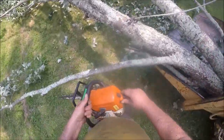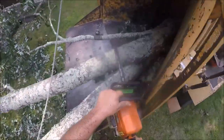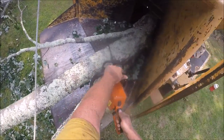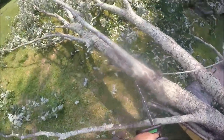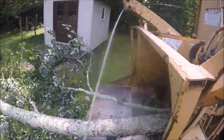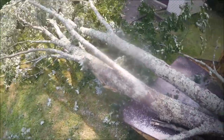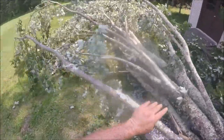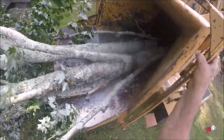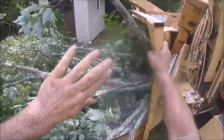This is all pretty basic stuff - I mainly wanted to point out the spinning of the brush and re-manipulation using a snatch block. It's in the feed wheels. I don't want to have to fight anything, so get out the old Fisher Price saw. Break that thing - I try and break these if I can so that I don't have to re-feed. It's just so the crotch breaks easier when it gets into the feed wheels. We're gonna turn on to regular speed for the feed so you can see how long it takes. That's it - thanks for watching. Hope you learned something. Got something you want to teach me? Feel free to leave a comment. Thanks for watching.